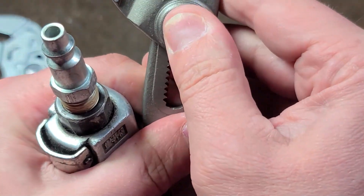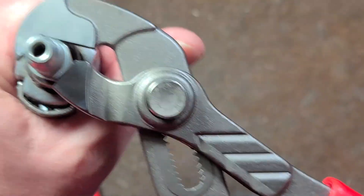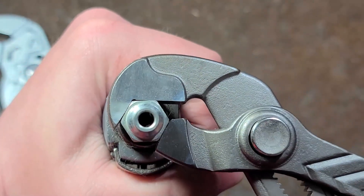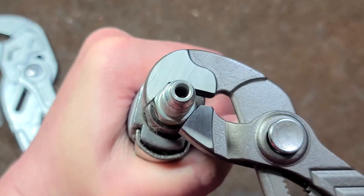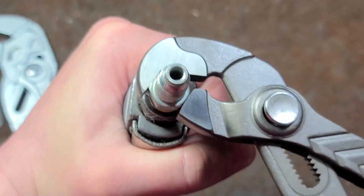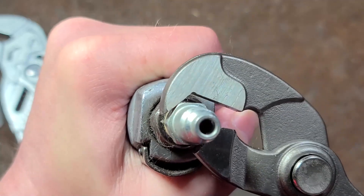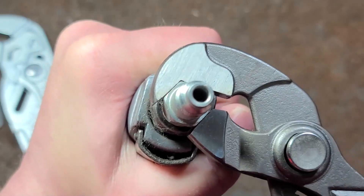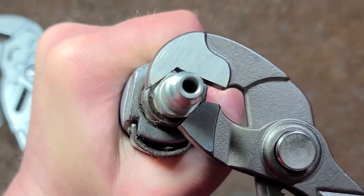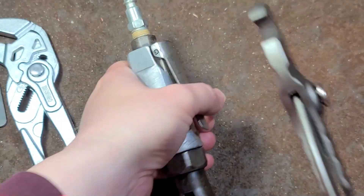And that's what's annoying about these. It's just the fact that with parrot nose pliers, the idea is that you just put them on and then you can put a tremendous amount of force on the moving handle and they just grab. But in this case, if you're not paying attention, what you'll end up doing is — these just end up being really good at rounding the corner, because that's what's going to happen. You'll put a bunch of force, but not quite enough, and as that jaw goes it's going to be grinding off the corner of the fastener.